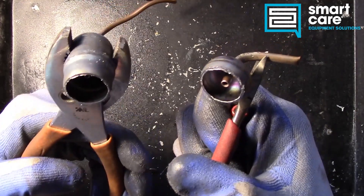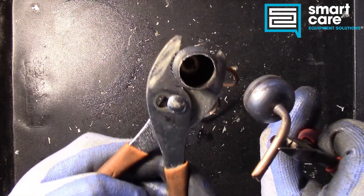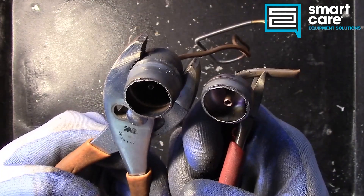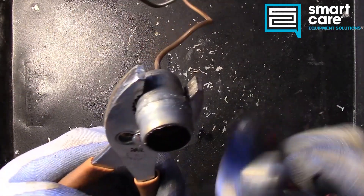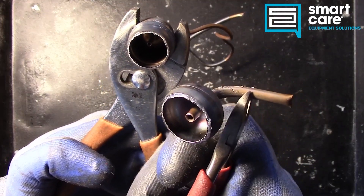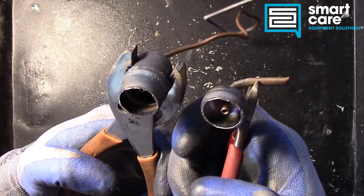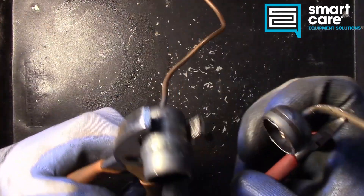Now that we've got it open, you can see that it is just hollow inside. They have extended the inlet and the outlet tubes into the middle of the hollow space, so the tube coming in has a bit of a neck to it and it points directly at the tube going out, but there's a gap in between them. We've got this big open space in between, and I'm pretty sure at this point it's acting like a shock absorber for those pulses — the refrigerant inside the bulb absorbs some of that compression as the piston comes up and forces high pressure vapor down the line.